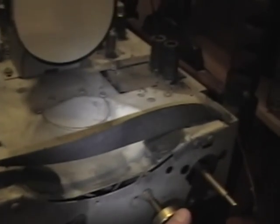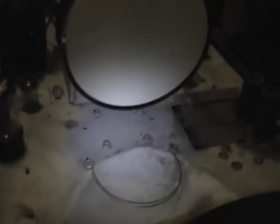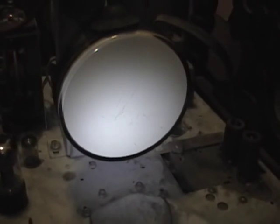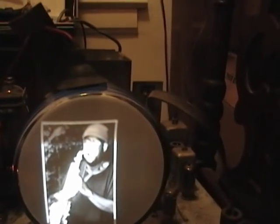Let's see what happens. There's a nice hum when it turned on and the tubes are glowing. No light yet on the CRT — hey, I wasn't expecting that to come up so easily! Focus is horrible and it's off center. Let me turn off the light on the camera so you can see that better. Using the controls without knobs — that must be the brightness, and that leaves contrast. Not bad!